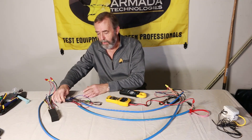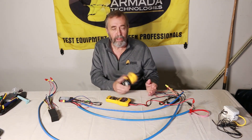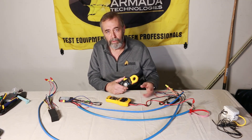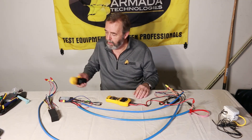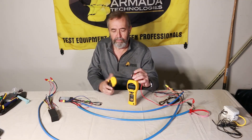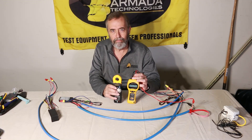If one of these had a bad splice or corroded splice or something, the current would not be nominal and I could see it very quickly with my milliamp clamp meter — the current would drop off. Or if it was a short, the current would shoot up, and I can spot exactly what point in the system this occurs. So it's a pretty handy way of non-intrusively checking the field cable for issues.